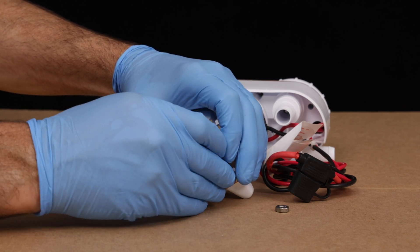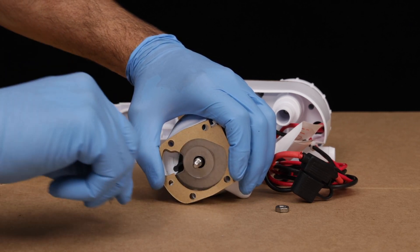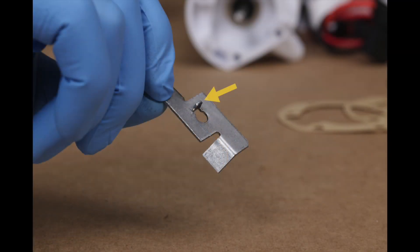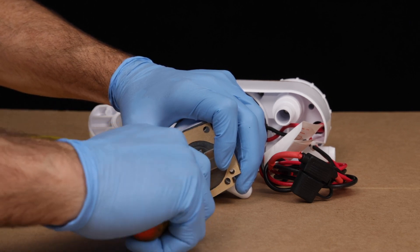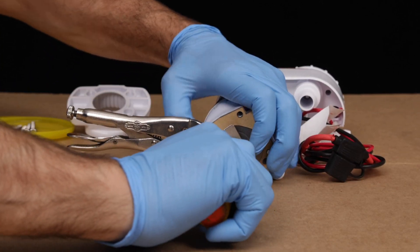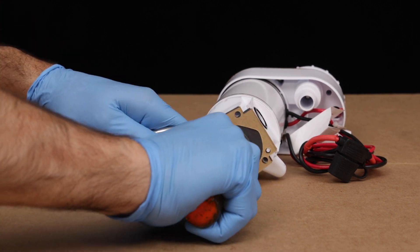Note that the pins assure correct positioning. Then, holding the wear plate against the body, line up the flat spot of the chopper hub with the matching flat spot of the shaft and reinstall the chopper, making certain that the chopper hub notch is facing toward the motor. Next, firmly holding the chopper in place against the body, reattach the nut until the shaft begins to turn. Then again secure the shaft with the needle-nose vise grips as you fully tighten the nut until it bottoms out and the chopper is firmly in position.